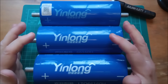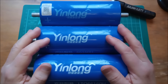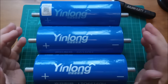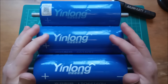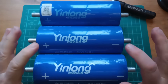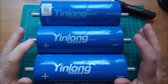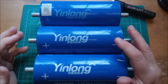There's temperature range. These cells can be charged and discharged at very low temperatures and quite high temperatures — down to something like minus 40 degrees C. YinLong say minus 50 degrees C and up to 65 degrees Celsius. So you can charge these well below 0 degrees C, which of course you can't really do with LFP. The next thing is cycle life — I've seen numbers ranging from 20,000 to 30,000 cycles, which is massively higher than NMC cells and even an order of magnitude higher than LFP.